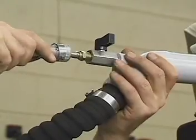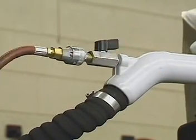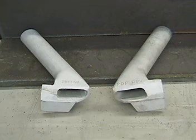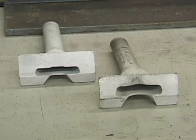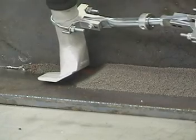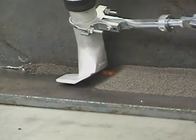The flux recovery system operates by compressed air supplied through user supply disconnects. Recovery nozzles are available in right and left-handed models for fillet welds and two different sizes for butt welds. Flux recovery nozzles are designed to be dragged along behind the A2 multi-track with the extended tab resting on the base metal.